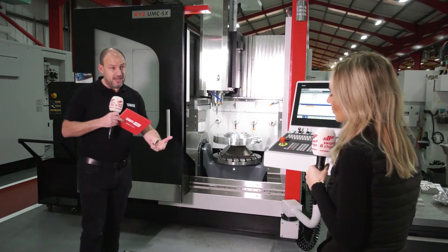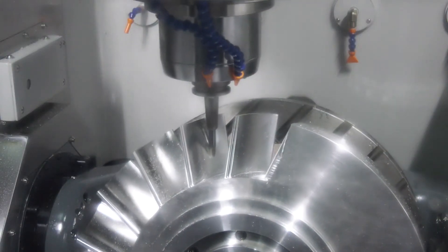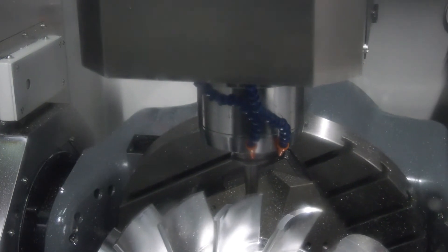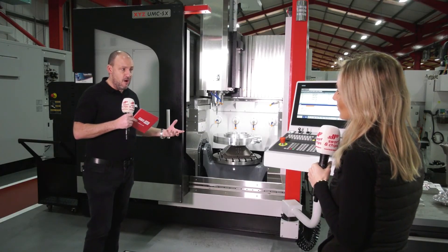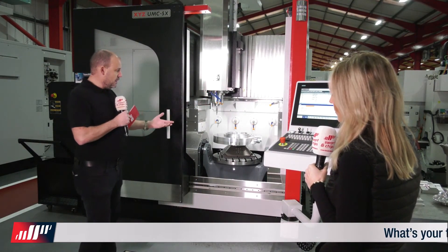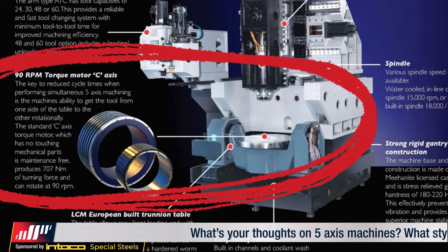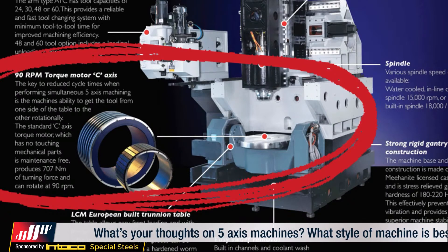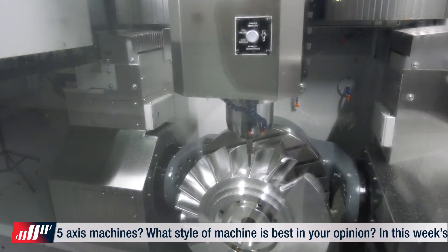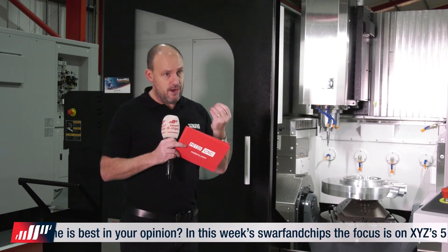If the application was lightweight, you might not necessarily need those two supports. But if you've got a component up to 600 kilograms — which is what this table can take — you have to consider how the table is going to support the part from day one for the rest of time. Also encompassed within that is how the mechanics of the table move. This table has a high torque motor, which means no backlash. When it goes backwards, forwards, clockwise, anti-clockwise, it's immediately responsive, which gives you extra accuracy.